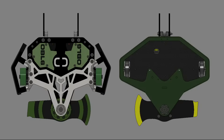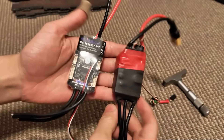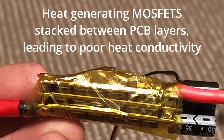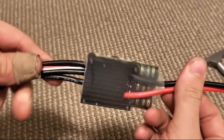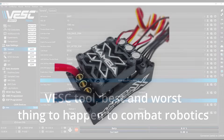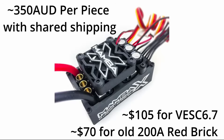Compared to Obliterator 5, the wheels are shifted further forward to approach the centre of mass. It's debatable whether this is actually a good idea, as it's trading stability for adhesion, but I'm keen to give it a go. Electronically, the robot is rather basic. Rhino 80 AM32 ESCs will control the drive motors, with a large 6S battery supplying everything at just over 25 volts. Powering the weapon motor is either an old-school 200-amp red brick, or a more modern VESC 6.7. The former has plenty of burst power but terrible thermals due to the stacked construction. A VESC is smart, capable of limiting itself appropriately to run a whole match without trouble, but incapable of handling the massive start-up currents that a red brick can. Some more specialised ESCs were recommended to me, such as the Castle Mamba line, but at 350 Australian dollars shipped apiece, they were absurdly expensive — triple the price or more. While I believe they're a good choice, I want to try and get by with less.